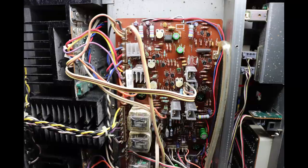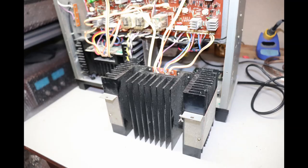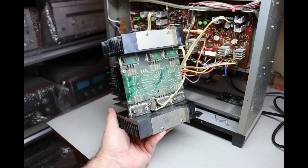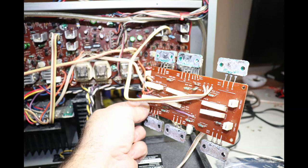I've started removing the heat sink assemblies out of the Alpha 440 — they're pretty dirty; everything you touched or took out had layers and layers of dirt to clean up. With the heat sink assembly removed, I'm able to access the power transistors and the interface assembly that connects them to the heat sink. Taking this apart like this, the best thing is to put in some new insulators and new thermal compound on those output transistors. All that stuff is 40 years old and dried out; if you can keep those transistors running cool, there's a good chance they'll literally last forever.